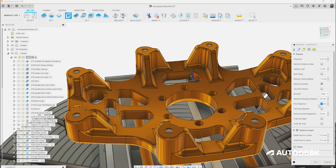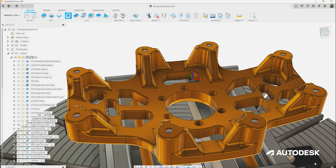This is where the minimum step down comes in. The larger the value, the larger the roughing steps will be on the part. Reducing it will help with the finishing process, however it will increase cycle time. This is a balancing act between efficiently roughing the component and ensuring the finishing tool paths are not having to machine excessive or constantly changing amounts of rest material. It's not uncommon for additional material left over from roughing to show through as poor surface finish on the final finishing operations.